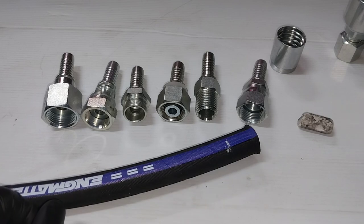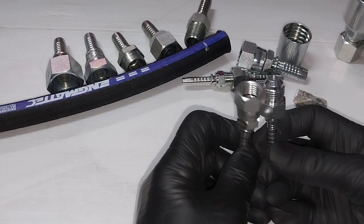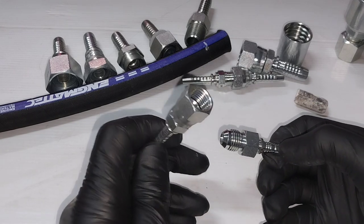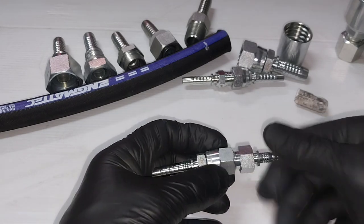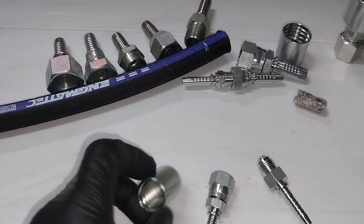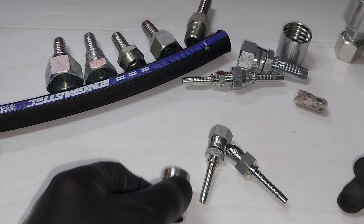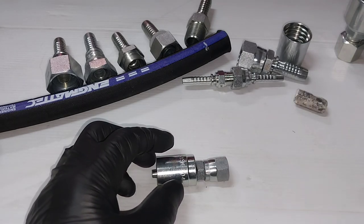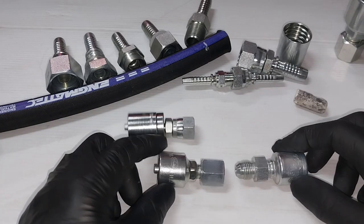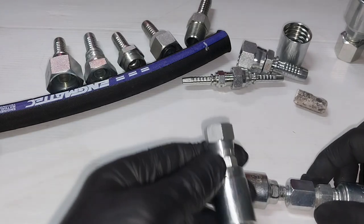Again, available in lots of different sizes. These are a two-piece fitting in JIC, 1/4 inch tail. That's a 9/16 male JIC, that's a 9/16 female JIC, designed to connect together when you're connecting long lengths of hose together. Again, same thing, variable thread, lots of different threads. The same shell can go onto this fitting, as the same shell can also go onto that fitting. You're not having to buy multiple quantities of one-piece fittings, right? But then again, if that's what you prefer, these are available. Yep. One piece, two piece.